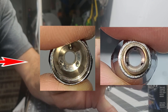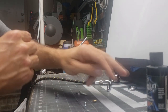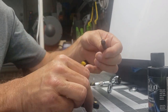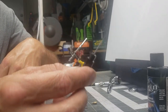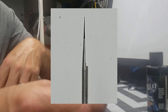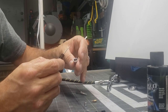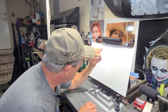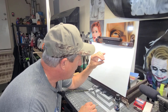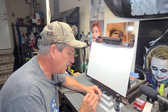There's three little air holes in that nozzle. There's a tool that you can buy — I got a couple of these now because some of the cleaning kits or things I order, this tool comes with it. It is a very, very sharp tool and it is for exactly cleaning out holes like this. So the first thing you want to do is hold that thing up to the light and see if you can see daylight in the holes. Now I can only see daylight in one hole — I clogged this up on purpose. I put some paint in two of the holes just so you can hear the decrease in air pressure.